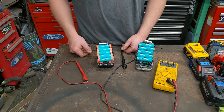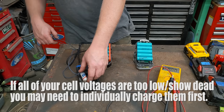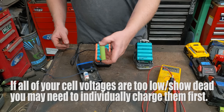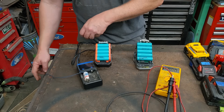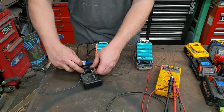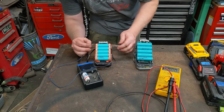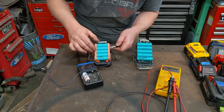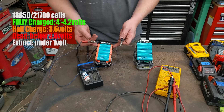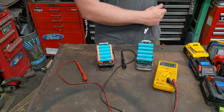All you have to do is replace that cell. For the battery that won't take a charge, the safest way to test individual cells is with an 18650 cell battery charger — about ten bucks. I've added a cardboard plug and some alligator clips so I can contact each cell's positive and negative while it's in the pack, charge each one individually, and see which one took a charge and which one didn't.